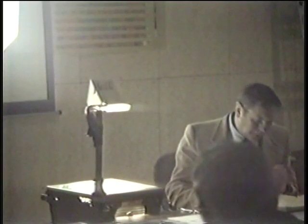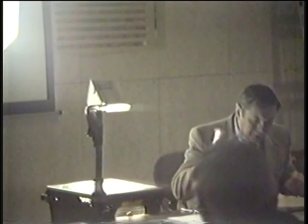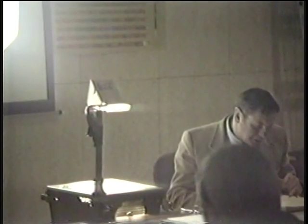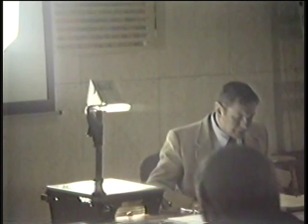Translate in your own mind for me. So we have the narrower head on the standard head. Now, the other pair of heads are wider, but we'll talk about those on the next page. In the meantime, point 3 here on page 13 is new de-emphasis. Now we're talking about after demodulation. And the new de-emphasis is that instead of perhaps just a standard de-emphasis that we had before, where we had a certain de-emphasis for beta 1, a different one for beta 2, and a different for beta 3, we now have them altered still in a different way between super beta and normal.